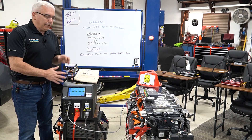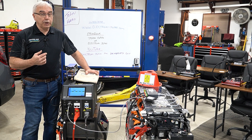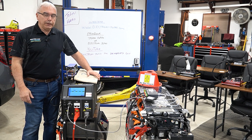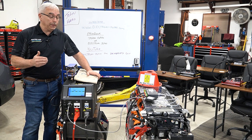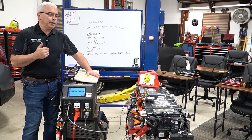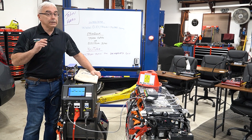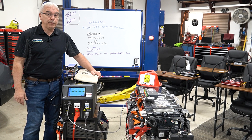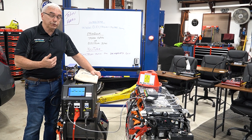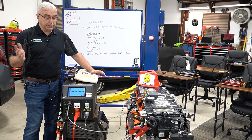So why would I ever want to discharge a battery? If you happen to store batteries — let's say you're a salvage yard taking batteries out of vehicles — we all know about lithium runaway. It's a dangerous condition that could happen, but it can't happen if there's no voltage or very low voltage in the battery. For storage purposes or transportation, there are rules and regulations depending on how you're shipping the battery pack. It either has to be at 40% charge or less, or 20% charge if you're flying it in an air freight scenario.